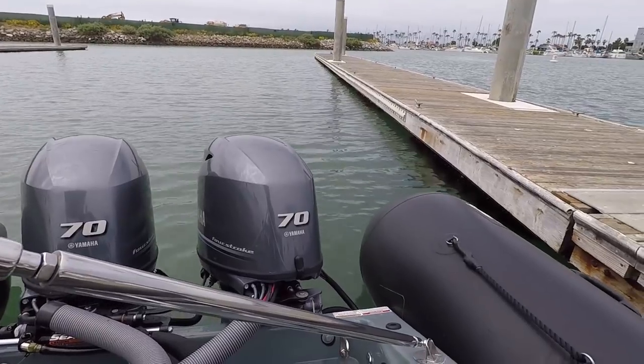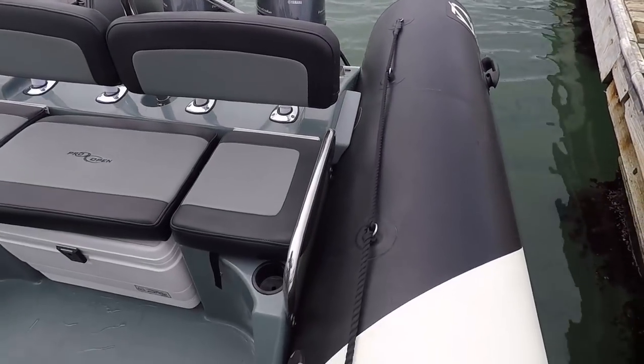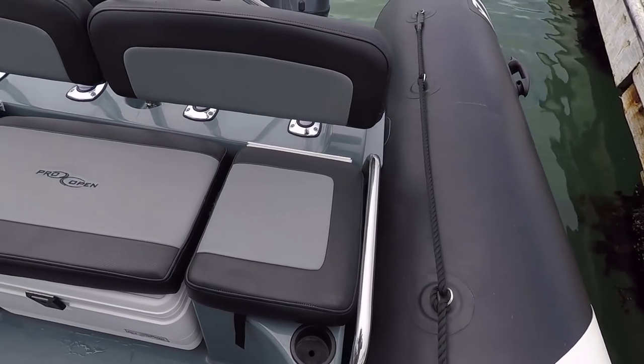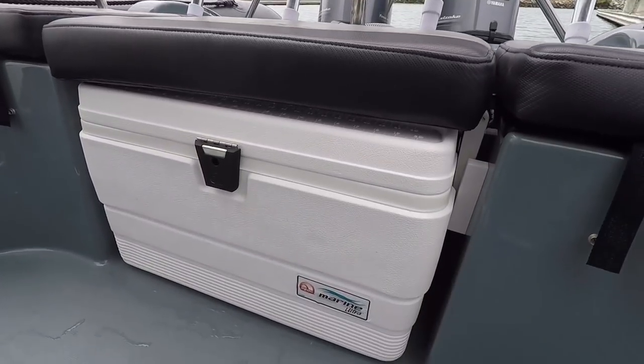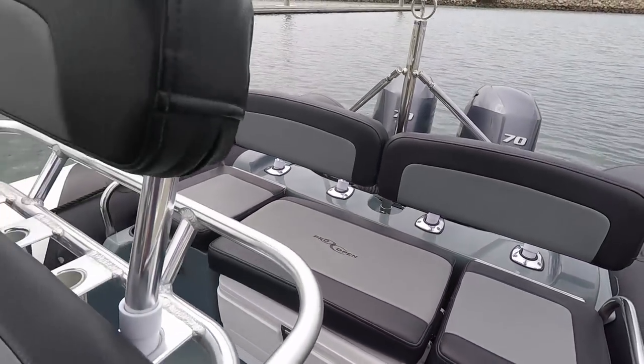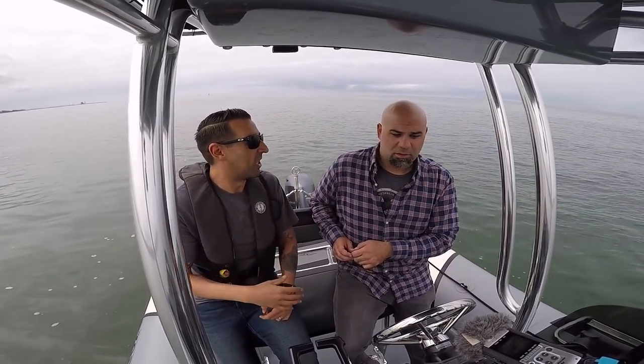And counter-rotating, of course, right? No, both standard rotation. Really? You don't get into counter-rotating until you get into the 150s or so. Oh, okay. With the 150 setup, however, what I can tell you is you have a higher top-end speed. It's 51 compared to 42-ish with the twin 70s. However, to achieve the 51, you're usually chine walking, so it's unstable, so you usually don't get that performance out of it.